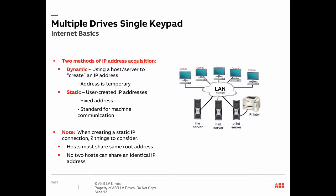Before we continue, we have to cover some internet basics. To control multiple drives via Ethernet, we need to set up a static IP connection between drives. Internet rules dictate that for two internet-enabled devices — such as a computer, printer, or drive — to communicate with each other, they must be on the same network. Networks are defined by IP addresses. Devices on the same network must have similar IP addresses. This is analogous to all people in the same city having the same area code, or all people in North America having to dial a phone number with a prefix of 1.